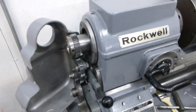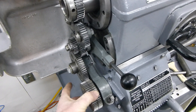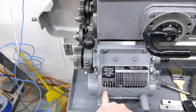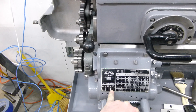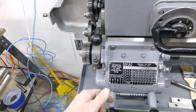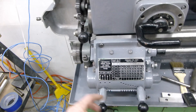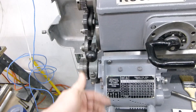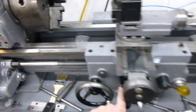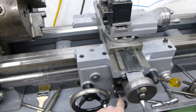The good news is that once I did that, everything is clean. There's no broken teeth and there's really no wear. There are one or two gears on the left side that have a little bit of a hitch — as I'm turning it by hand it had a little catch every revolution — but that's not too bad and doesn't really affect anything. There's one gear in there that looked like it had a little excess wear, but it still has a lot of life left in it, so I'm not worried about it.